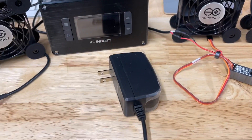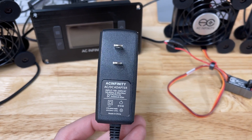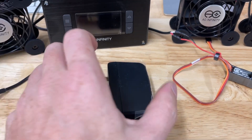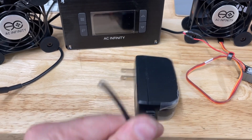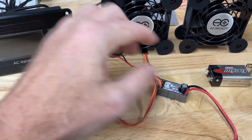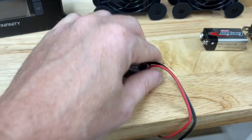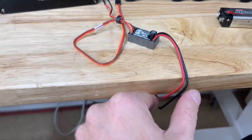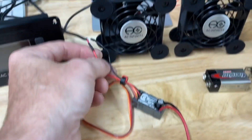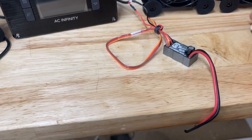The big thing I want to show you is this right here — it's a 6.5 volt output 2 amp max wall wart. I don't want to add a power inverter in the car, so I cut this and wired the end of it to a Castle Creations BEC 2.0. This is from the RC world. You wire this into your lithium pack and program it, and you get whatever output voltage you want. I've got this one set up — I'm going to show you guys.